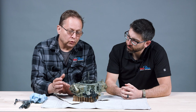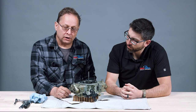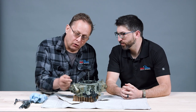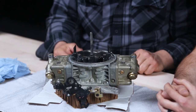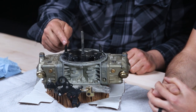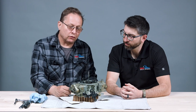The problem I had on my carburetor was that I didn't notice the fuel pressure was too much. If a carburetor is supposed to run at six or seven pounds of fuel pressure and you have nine or more, that fuel pressure will overwhelm the needle and seat — the valve that stops fuel coming in — since it's not really capable of stopping more than seven pounds. Too much fuel pressure filled up the bowl too much and then fuel came into the vent inside the carburetor.